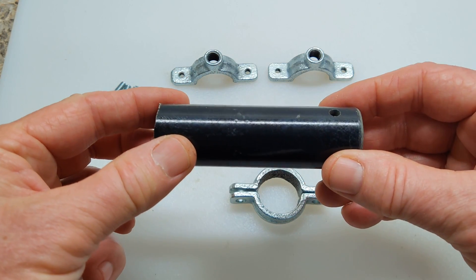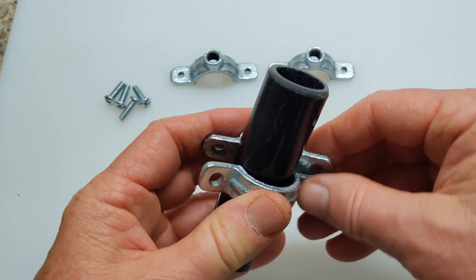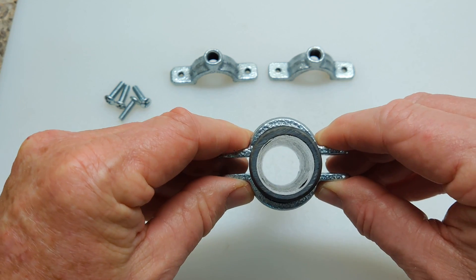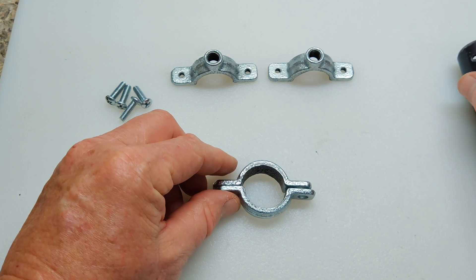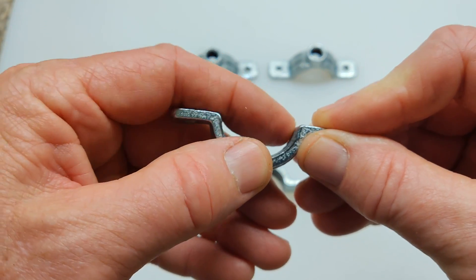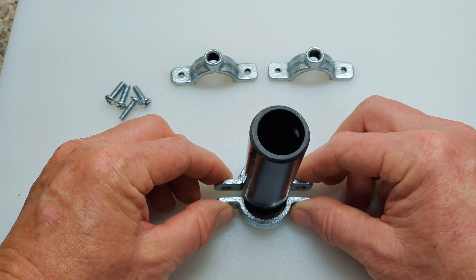This is a piece of 1-1/8-inch diameter trolling motor shaft. You want to put the hanger ends on either side to clamp it, but you can see there's a gap. You could tap them with a hammer and they would expand, but then the gap would get wide and won't fit in the gear teeth. What you need to do is grind down the little corner section on all four of them. I just used a file and filed it until it fit flush on the trolling motor shaft.